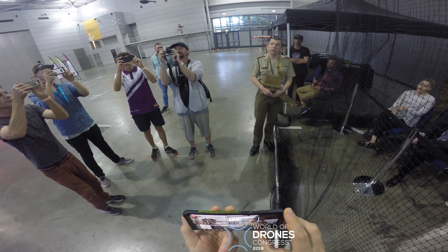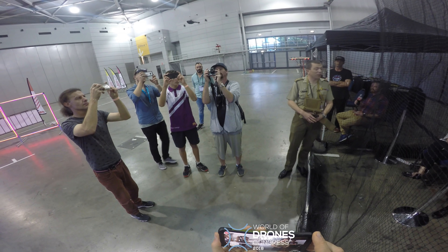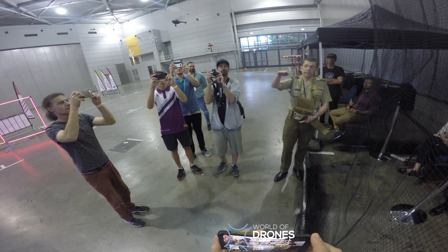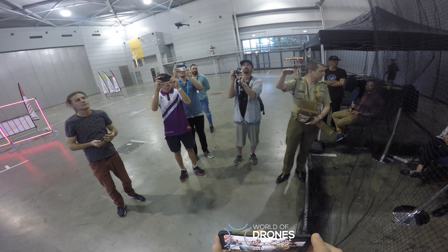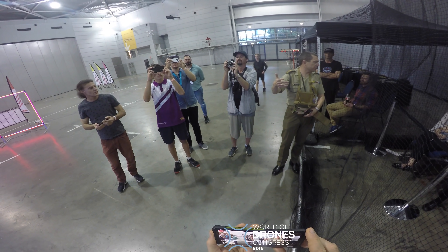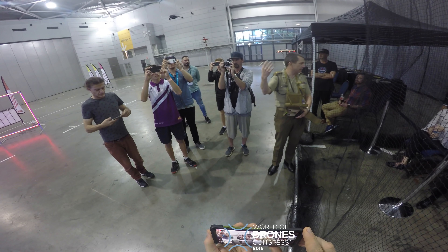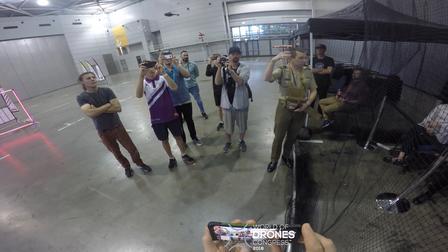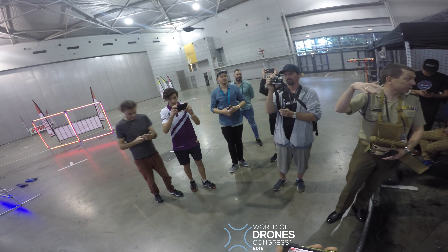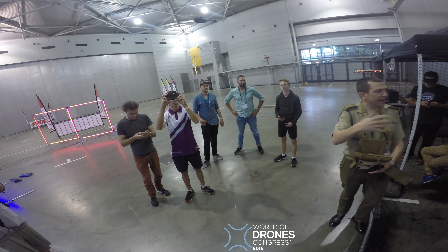I'm flying inside without a satellite connection. It means it's not as fast and not quite as good as when you're outside. Because if you watch it — see how it slowly oscillates, about five to ten centimeters — that's using the world's best optical navigation mechanism. With that five to ten centimeters worth of movement, the picture coming through the camera allows the little computer inside to use triangulation and trigonometry to maintain its position. It's all relative to the image that the cameras are seeing.